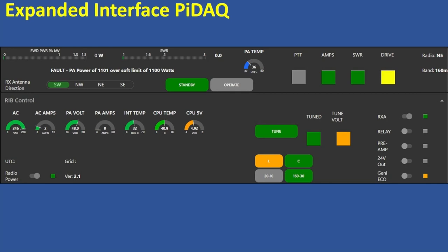We're using AnyDesk as our remote desktop for visual communications between the PC at the radio and the client who's operating the system. We're using Sonobus, which is very cool for audio. What makes it work really well, especially over satellites, is that it has dynamic buffering in both directions — you can set the depth of the buffer or let it run automatically. When you have networks with varying latency or jitter, it really helps with delivering a quality audio signal. We're also using N1MM, of course.